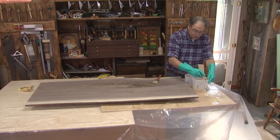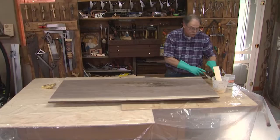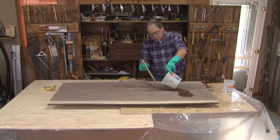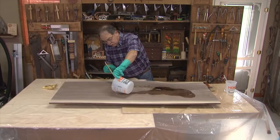And anyways, here's what goes on. It's thoroughly stirred now, and that's key. And these bark inclusions were sealed with Timbermate and then sanded to perfection. Surface preparation is very important here. And so what I'm going to do is pour this out and then spread it around, and it's self-leveling. But you do want to move out very quickly. And so I'm coating the center of this area.